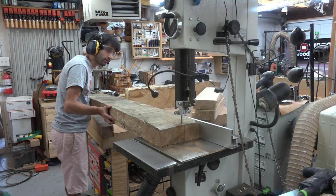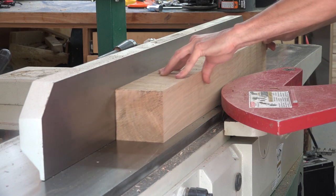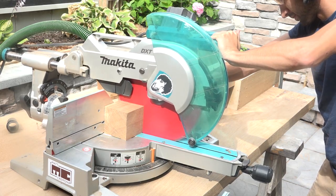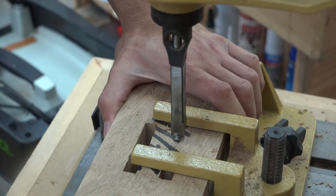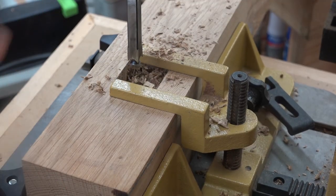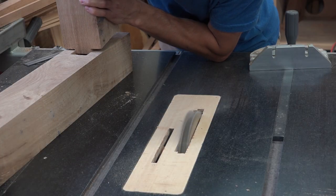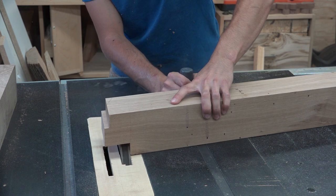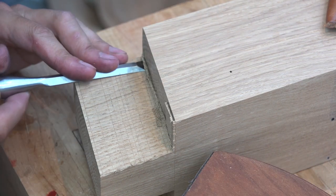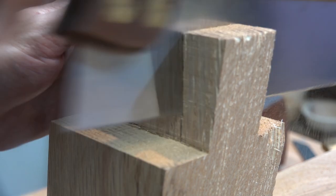Now onto the base of the table. All parts are broken down from double into single, then everything is milled down into square stock — the base material ends up at three and a half inches square. All parts are cut to their final length, with the ends of the legs cut at an angle since they splay out. For the joinery on the side assemblies, I cut mortises into the upper rail and into the legs for the lower rail. The tenons are all angled, so I lay out the angled shoulder with a knife line, then use the table saw to roughly remove stock, and chop directly back to the shoulder line for a perfect fit, then cut to final width with a handsaw and chisels.